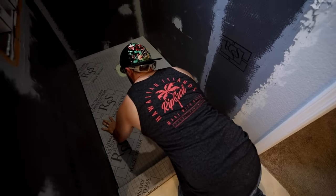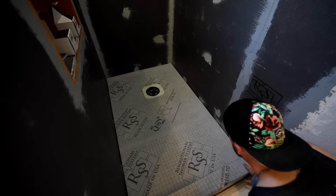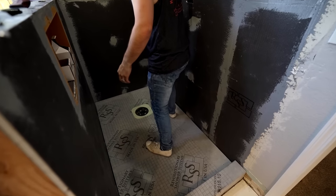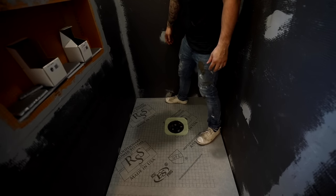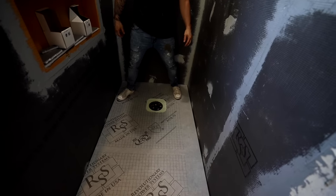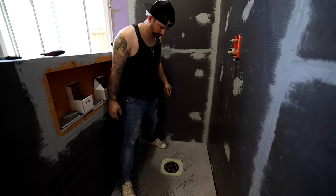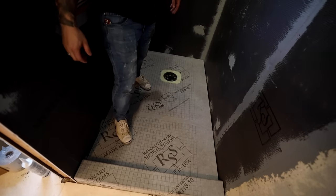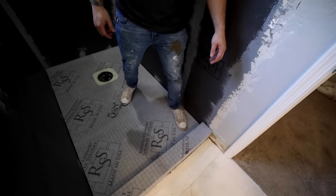Perfect, yep. So what I do, Eric, is I usually stand on those bad boys. Don't stand right around the drain because, again, that mud is still a little bit wet, but walk around the perimeter and just kind of try to shake it back and forth. And you'll probably hear the little air coming out of it as you go. That'll really lock that pan. What that does is it collapses those ridges in the half-inch notch trowel. You can hear the air coming out of it and the little sounds that it makes. Perfect. Yeah, we call that the foam pan shimmy right there.